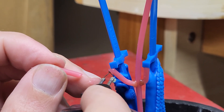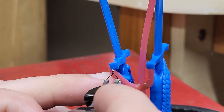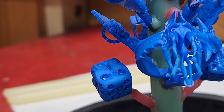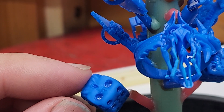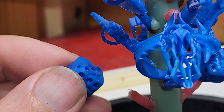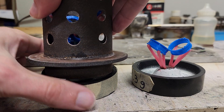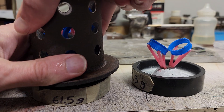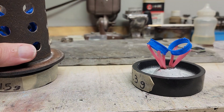The pieces are now prepared for casting by attaching them to a sprue tree. I had some difficulty getting the wax to stick sometimes. Even using sticky wax, or white wax as it's called, would not stick well enough without sanding the surface first. With the sprue tree complete, they are placed in a flask for investing. I'll be following my usual burnout schedule, which typically runs from 8 to 12 hours, depending on the size of the flask.